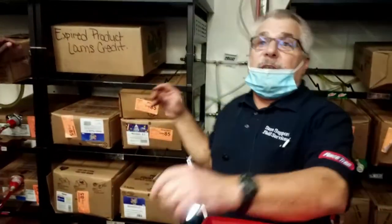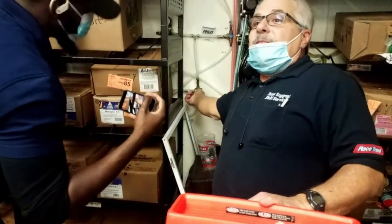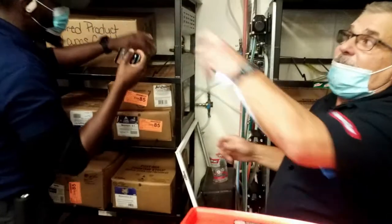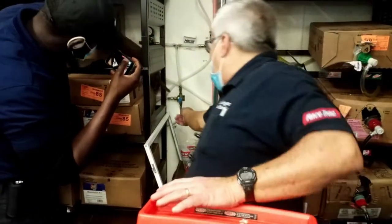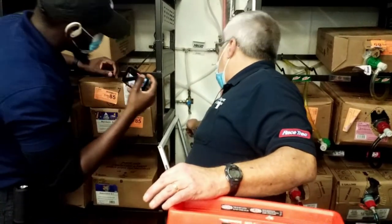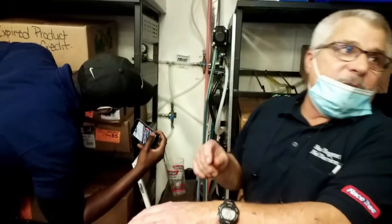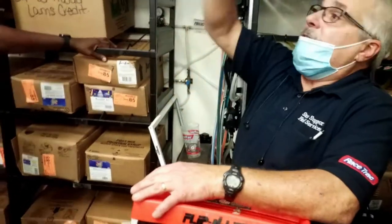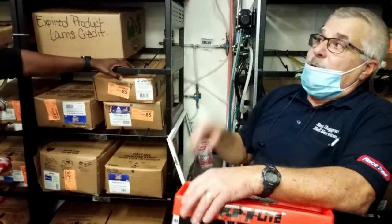Yeah. So every store is going to have one of these valves somewhere. That's some air or CO2. In case that air compressor dies, you turn it over to CO2. It should be marked air or CO2. It should be marked emergency, right. And now you turn it to CO2. Now everything runs on CO2 pressure. Get all your pumps back up and running so we can replace that.